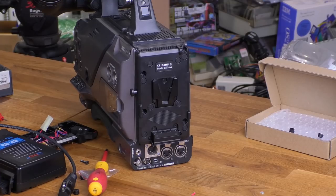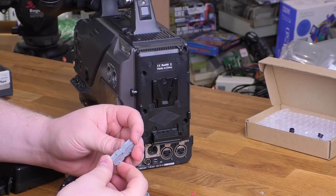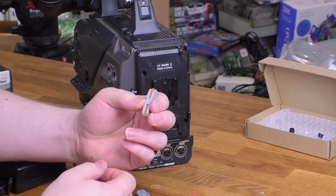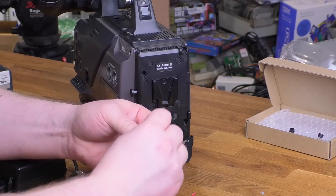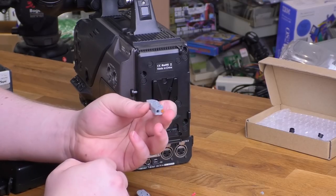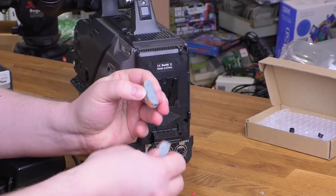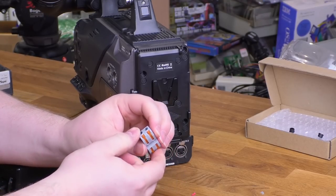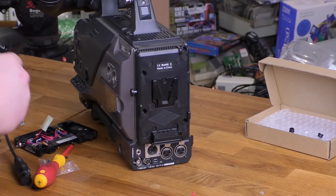You may have noticed I was struggling to use these things, which I think are called lever locks in their actual trademark version, instead of the Chinese knockoffs I have. I'm a person who's staunchly opposed to commitment of any kind, so I wanted to use these instead of soldering or butt crimps. With these, you just flip this lever up, poke the wire in there, and then pop it back and it grips it — and that way you can reverse it at any time. Of course, they're gigantic, so I had to trim down the little mounting notches on the side that let you couple them together. They just barely fit in that space.